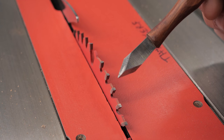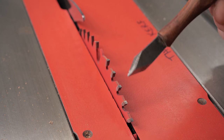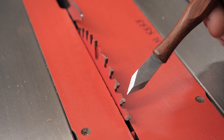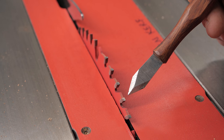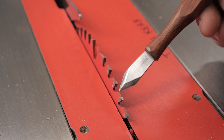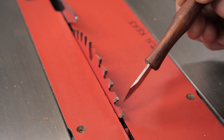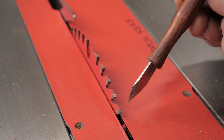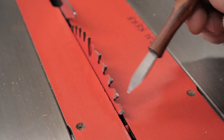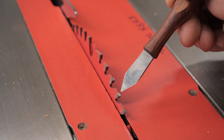This table saw blade is an ATB — alternate tooth bevel with a flat bottom tooth in between them. Like any saw, whether it's a hand saw or an electric saw, they're going to have tooth set. The blade needs to be thinner than the teeth so they have room to clear chips — that's what the gullets are for. That's where the sawdust goes when it's cut and carried out the back side. It also allows air in to cool the cut and keep it from burning. So the teeth stick out further than the saw blade, which means if you're measuring arbitrarily to the blade body, you'll never get a super accurate cut. You need to measure to the tips of the teeth.